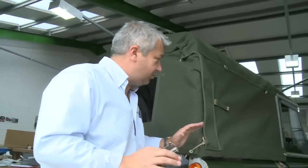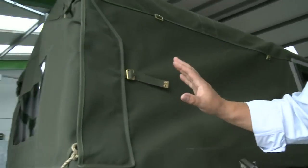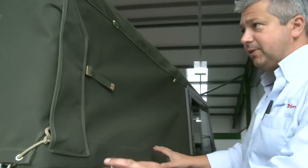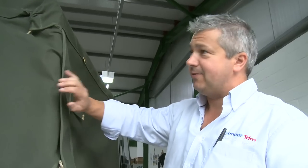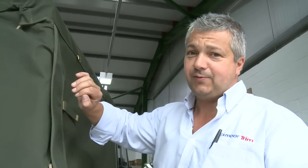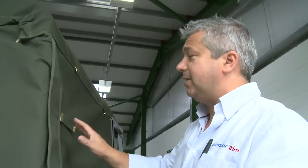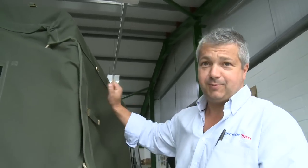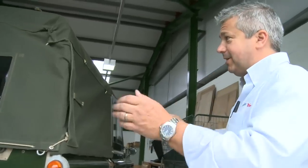And when you fit new hoods, you always get a little bit of slack and creasing in the hoods. The secret is to keep the hood nice and taut for at least the first few weeks, because being a natural cotton canvas, they have a tendency to have a little bit of shrinkage. We allow for shrinkage in the patterning, but you must keep the whole thing taut for the first few weeks. Then the hood should settle down and be a bit more like a drum to the sound, and have a perfect fitting hood from then on. So there you are, finished job.